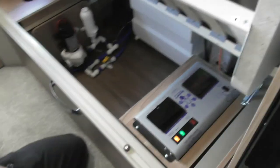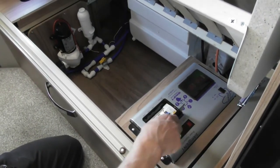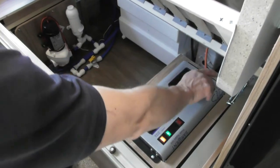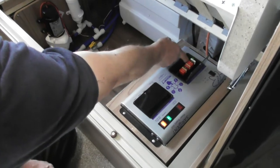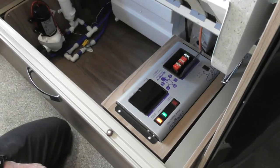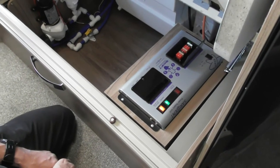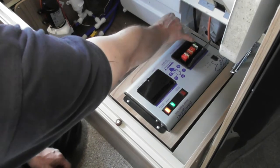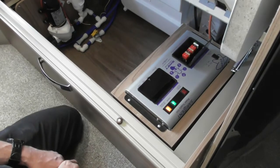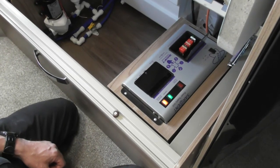That's the fuse box there, is it? Yeah. So what we've got is 240 trips. That's all obviously the electric side of it. That side is your 12 volts, so 12 volt fuses. The far one, the white one with a green light against it, that's your charger fuse. If it's got a green light on it, that's okay, that's fine. Is there any spare fuses here? Yeah, there should be some in the pack. Also, what you've got is LEDs alongside all these other fuses as well. If they light up, that means that fuse is gone. That's a good idea. Yeah, that's new for this year.